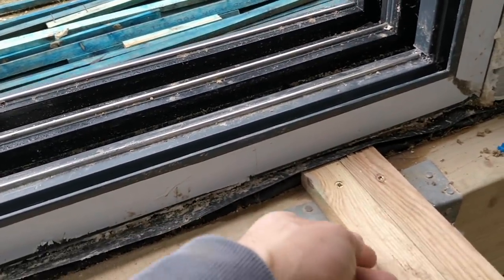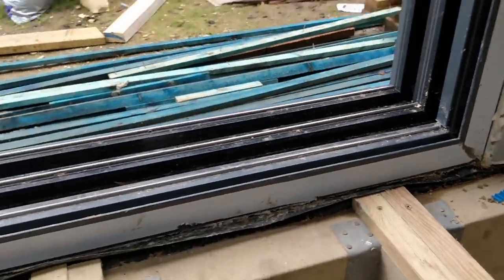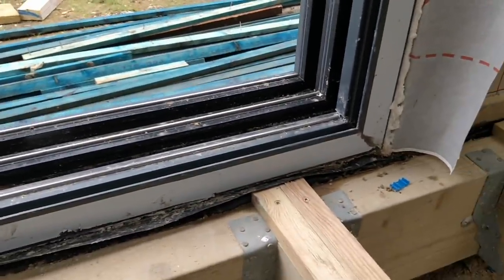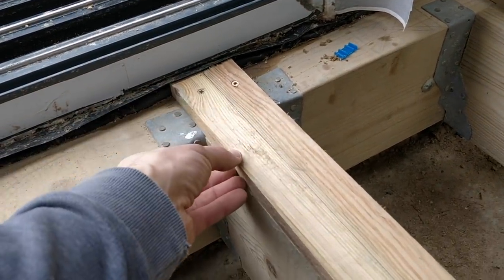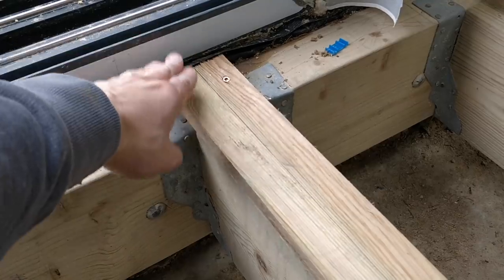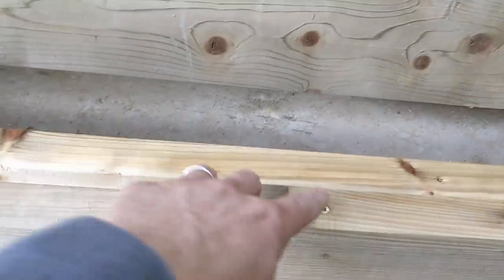So I know that I've got 22mm of chipboard flooring plus 6mm of ply plus another 4mm of Carndean or whatever it is. We're going for a luxury vinyl tile, so it's between 3 and 5mm, so 4mm. And so that plus this batten here makes up the difference quite nicely, actually. So yeah, I'm going along and I'm basically just screwing it in.